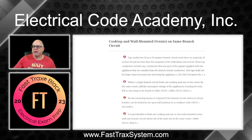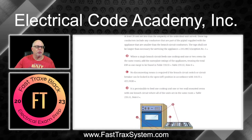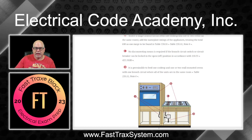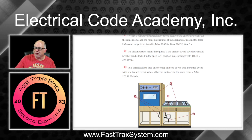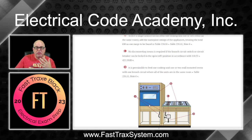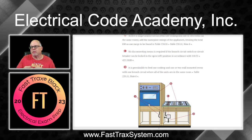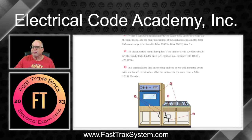Here in the lesson, the first thing to remind you — and I'll show you a picture, because it's worth a thousand words. This is the branch circuit right here at the bottom, coming from the panel to a junction box under the cabinet, and it's branching off with taps. These taps could be conductors you run from that junction box hardwired into the wall-mounted oven, or they could be a whip that already comes with the appliance. Either way, they're going to fall under these tap rules.